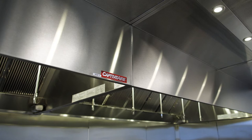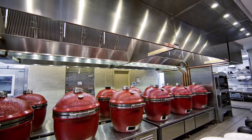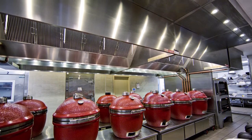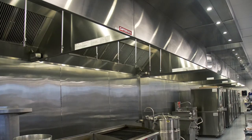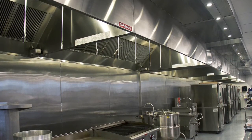You may also have end-to-end or back-to-back hoods, or several independent hoods in one kitchen. Those hoods are each designed for individual locations, and must be installed in those specific locations because of airflow, fire suppression, cooking equipment, and structural designs. Verify that each of these hoods is in the correct location before installing.